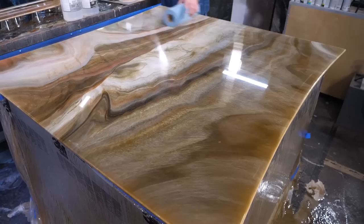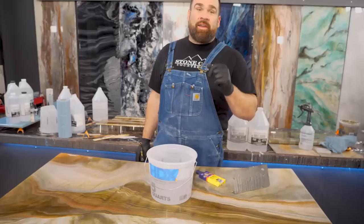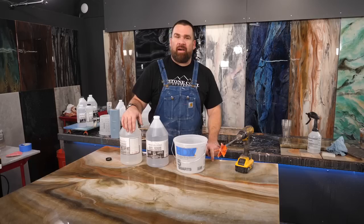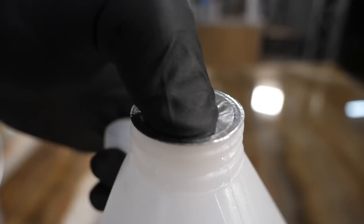After a quick sanding, clean the top with paper towels and a little bit of isopropyl alcohol. We're ready to mix epoxy. The tools needed for the clear coat are: propane torch, chop brush, eighth-inch by eighth-inch square notch trowel, and epoxy. For a clear coat, you need three ounces per square foot. This is 25 square feet, plus the apron gives me about 30 to 35 — I'm going to mix up 96 ounces of epoxy.